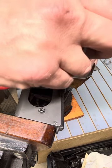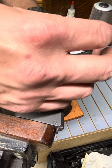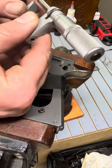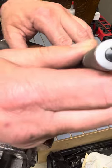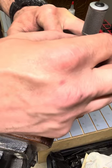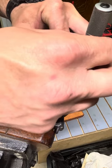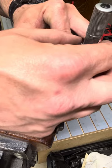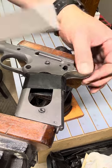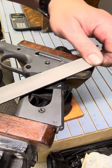First thing I'd like to get a little bit of an idea of how much we have sticking out. Using the stair step micrometer, that's about six to seven thousandths. So we want to bring that down to match the surface of the frame. We know we got about six to seven thousandths to take off.